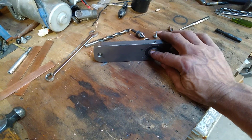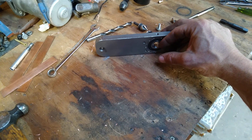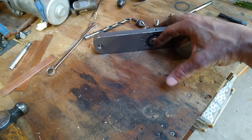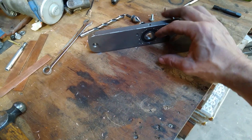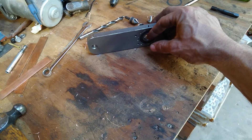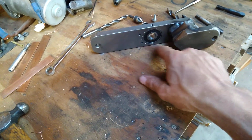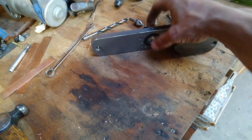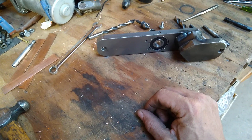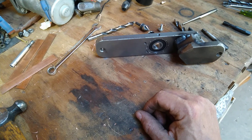So what I'm going to do is order another one of these bearings and space it down — you know, a quarter inch or something. I've got tons of room below this link. So I'm going to get another bearing, space it down a little ways, and just have a block right there welded to this. With two of these on there, that ought to do a pretty good job of holding that thing from twisting.